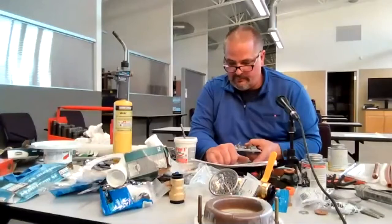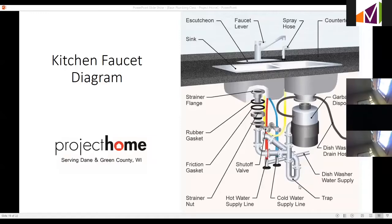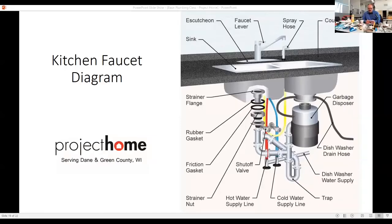You can also add an air gap if you have a regular countertop — just use the right size bit, which would be an inch and an eighth.